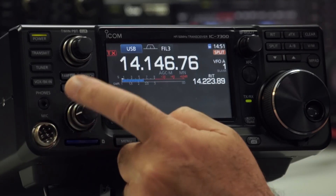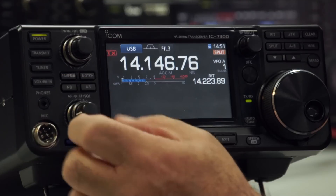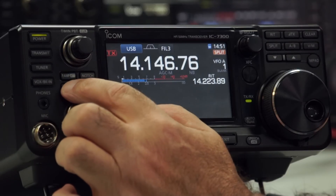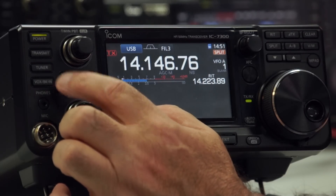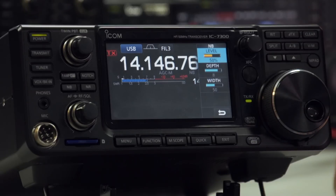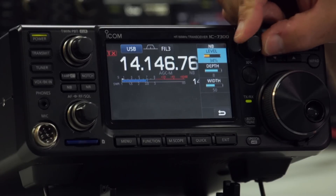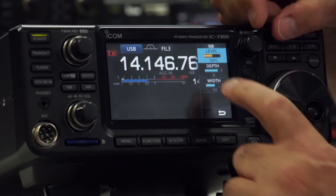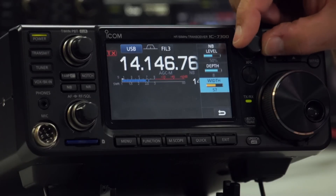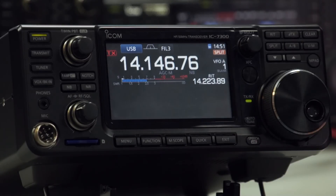The notch I've already mentioned. Noise blanker — I like the noise blanker on this, it's actually quite good. The noise blanker is for pulse noises, so if you've got ignition-type interference that will take it out. With all of these buttons, if you press and hold them, it produces a menu you can adjust. The noise blanker level is set to 50% by default; you can change the depth, and the width. 50% is about right — once you've set that up, forget about it.